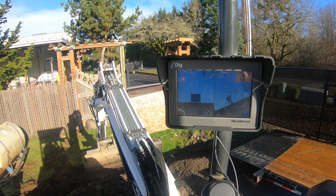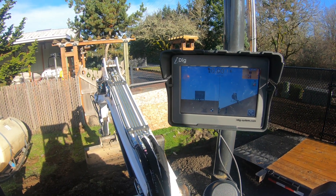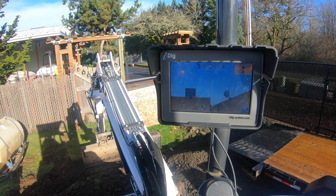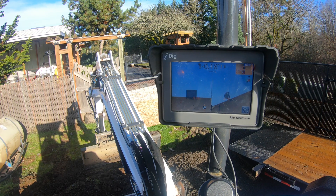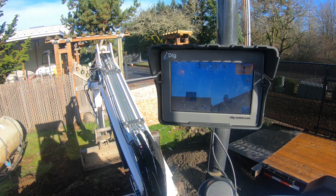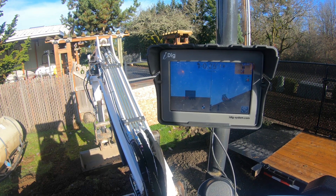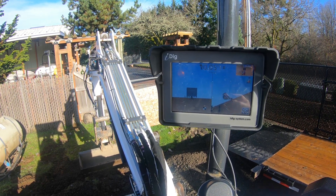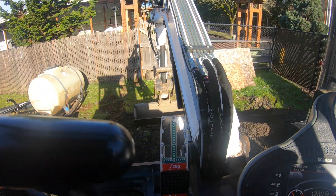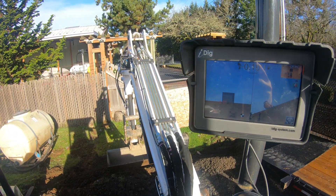So from here, if I move my bucket towards me, it's expecting that 45-degree angle uphill. And as you can see, I am not going up as fast as I need to be, and it'll keep telling me as well. I also have my LED sensor down here, keeping me updated on me being too low as well.